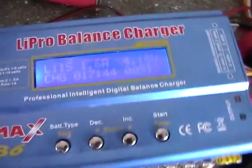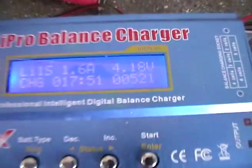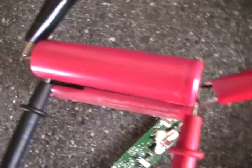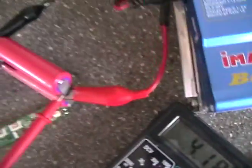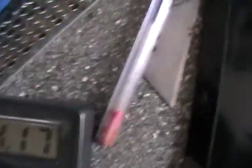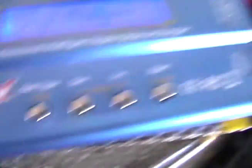You can see it's been on 17, nearly 18 minutes at 1.6 amps, so it's putting in a fair bit of juice. The start voltage when I took it out of the pack was 3.58V — some people say if they go below 3.7 or 3.6 that they're done for. That may be the case, but it doesn't appear to be. I'm going to stop charging now and we'll see what the multimeter does, which should give us a rough indication of whether we've got good batteries or not.